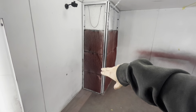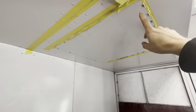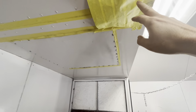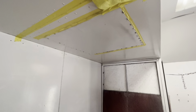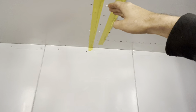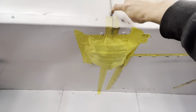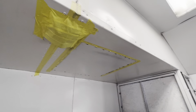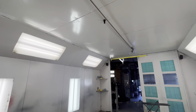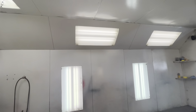The paint or the exhaust goes into here, goes up into this whole stack. This is a giant opening in here — it's hollowed and goes out. We did have a water leak coming down from the ceiling down the exhaust stack, and it was dripping in the middle of a paint job on the hood one time. I put tape here to get the water far enough away and sealed all this up to make sure no dust comes out. When I put the booth together I did caulk everything up tight — and very importantly, it has to be something that's not silicone based. If you're building a booth or putting one together, do not use a silicone product because it can contaminate your paint job.